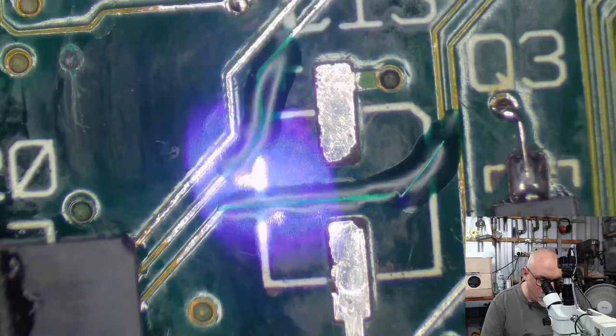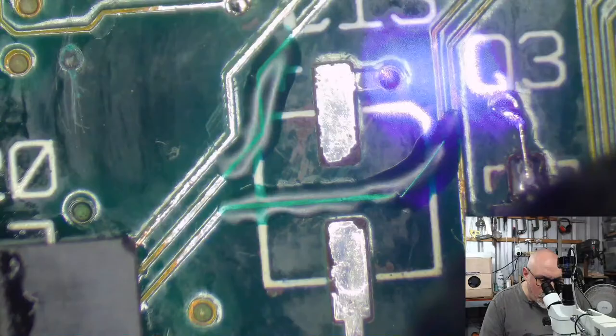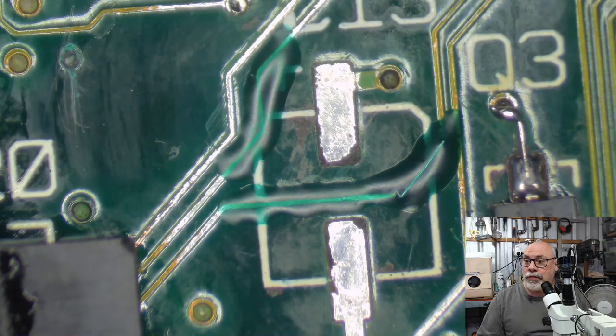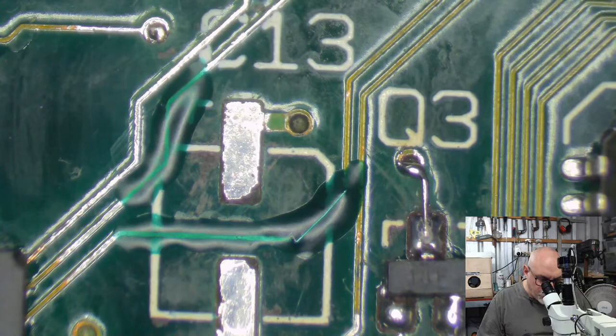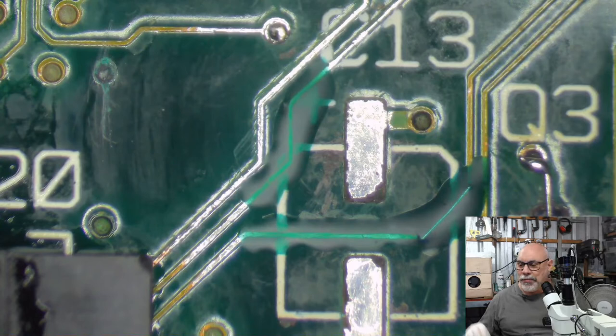The SE30 has surface mount electrolytic capacitors, same as this one here. Well, this is an SE30, that's why we're seeing that. And yes, they are way, way, way more prone to capacitor leakage. You can happily buy a Macintosh SE off eBay, and there's probably about a 90% chance you'll just plug it in and switch it on, and it'll work flawlessly. The hard drive might have failed, or a floppy drive may not eject anymore, but the computer will start up. Whereas if we are talking about an SE30, chances are, if it hasn't been recapped, it ain't going to work.